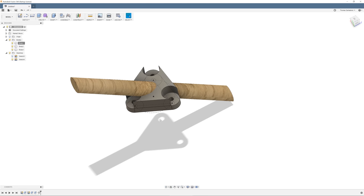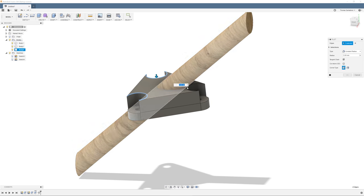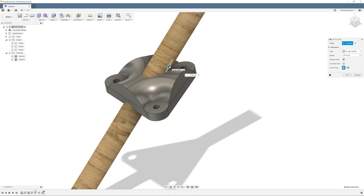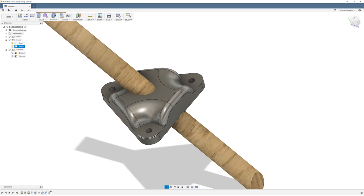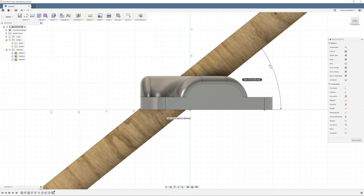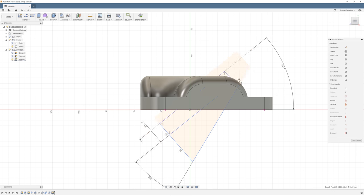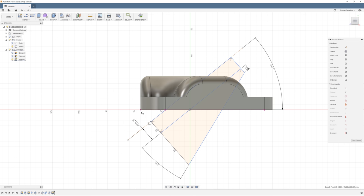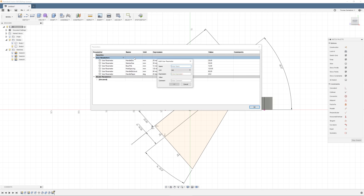I drew up the area where the handle meets the printed part as a dome shape, but I wasn't really happy with the way it sat. The contact area between the handle and the printed part isn't particularly long, so you get a lot of moment and torque on the printed part. While I'm printing this pretty strong and I know PLA holds up to a lot of abuse, it is still plastic at the end of the day. In the new sketch for the handle adapter, you can see pretty much all dimensions are parametric — the FX label tells you they're constrained externally and you can't just punch in a number directly.